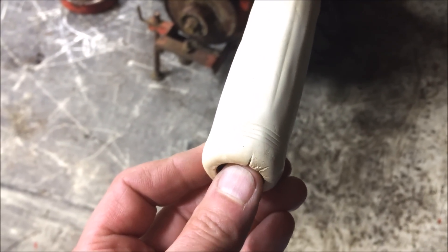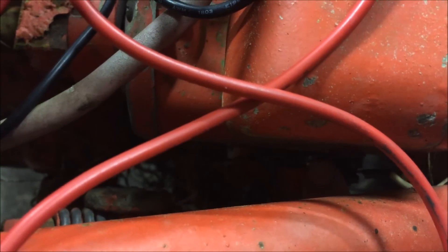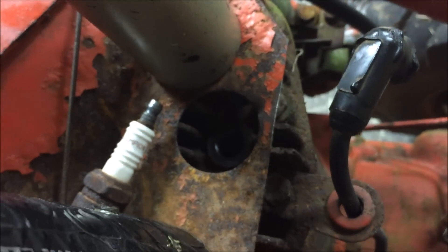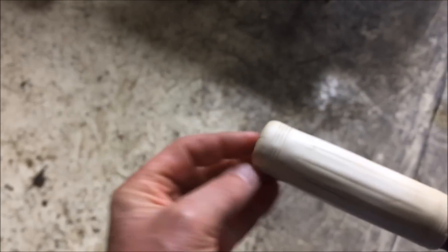The other kill switch is in the end of this panel bar here. You push it in and it kills it. So I took my multimeter and ran one lead to this bare metal arm right here that you would manually kill the tractor with, and the other lead to a little bare metal right there. And it showed that I have continuity. So that means this tractor will never have a spark until I figure out why everything's grounded out. I've been running a wire up under here trying to create a channel, squirting some lubricant in there, loosening this thing up. I'll get the handle off, check the stop switch and see what's going on. That's where I'm at right now, trying to get my spark.